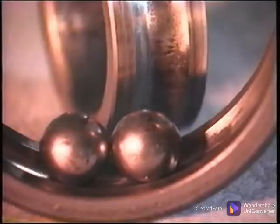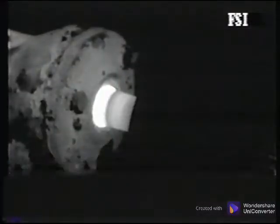Some mechanical problems can be clearly seen with a thermal image. When a bearing degrades or there is inadequate lubrication, the friction generates heat, which can show up as a hot area at the bearing housing or bearing mounting location. Remember that for most oil lubricated bearings, the oil breaks down at 160 degrees Fahrenheit. Bearings that are in this range are too hot.